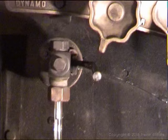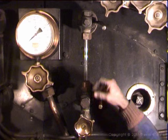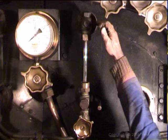Safety device. If you ever take off this protector glass from the gauge column, you must always close off both of those and open your drain cock so the water will go out, so there's nothing inside here. Now just a tip for these locomotives, for your own safety's sake, always check that they're operational. It makes it easier in case the glass should burst.